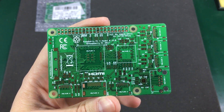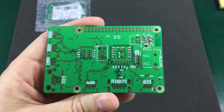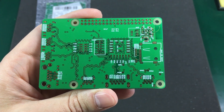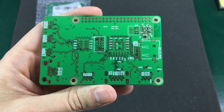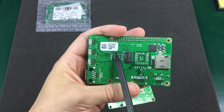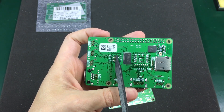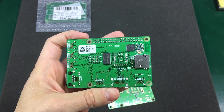On the back we have the RAM chip, which was salvaged from a SODIMM memory module. It's connected the same way with some exposed pads placed under the package. I've also placed a bunch of test pads, the same as with an original Raspberry Pi. The label on the board was actually a last-minute idea — I literally had a broken hard drive on my workbench that had this label on it, so I took it off the hard drive and stuck it on the board.